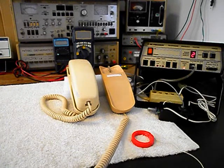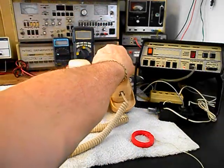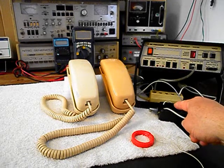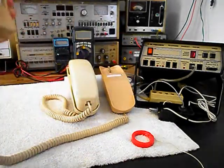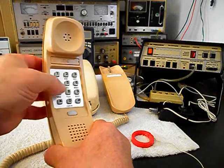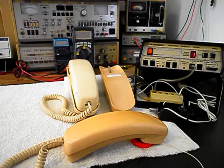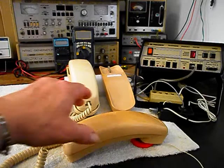1-2-3-4-5-6. 1-2-3-4-5-6. Hello, hello. Go ahead and hang our handset up. Now that we know that this unit is ringing in on our ring cycle, we're dialing out, we have transmit and receive. We can go ahead and press this button on the switch box — that gives us a line out, totally takes the analyzer out of the situation — and we'll call a time and temp number. The recorded message confirms: today is Monday, May 14th, the current time 5:16 p.m., and the temperature 86 degrees. We can go ahead and hang our handset up.